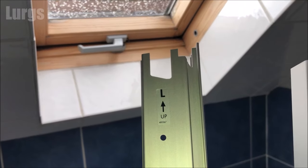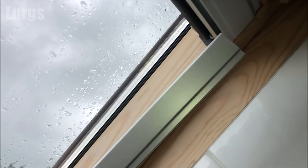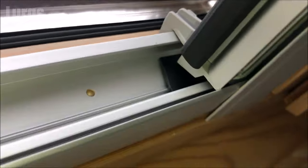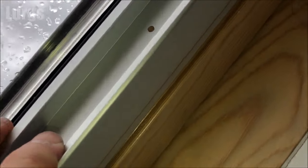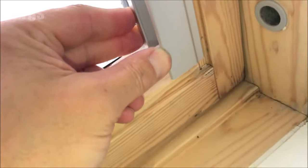You've got a left and a right runner, and this is left and right as you're facing the window. The right-hand runner goes on the right-hand side — what you do is flip it round so it faces this way. Then you're just sliding it up into the unit and the bracket at the top should just clip over the top. It might take a little bit of wiggling — don't try and force it. The runner should line up against the window frame on the inside and be nice and flush. There we go — that's now nice and flush against the frame of the Velux window.